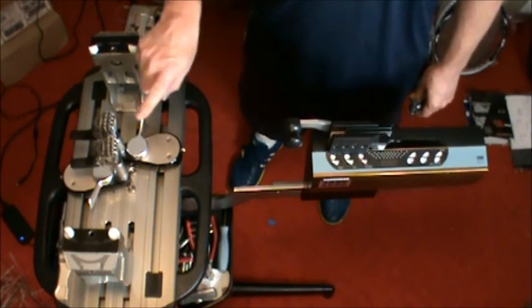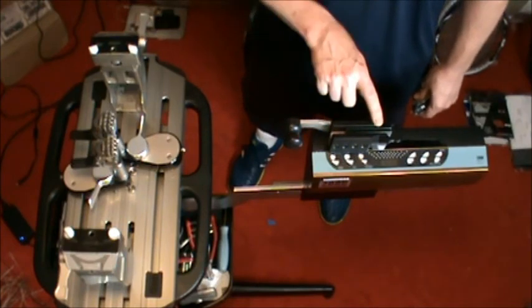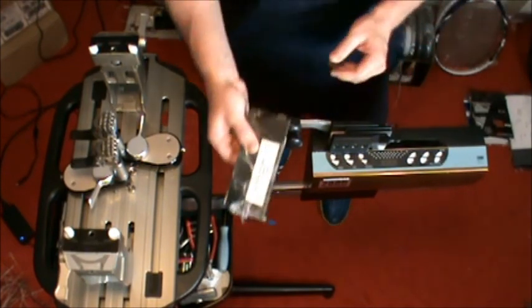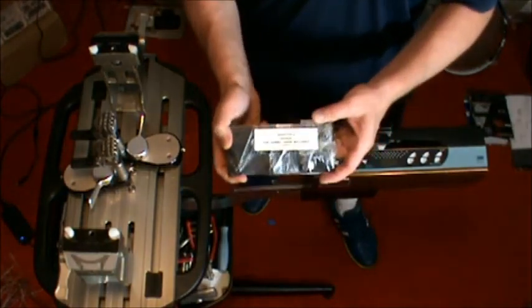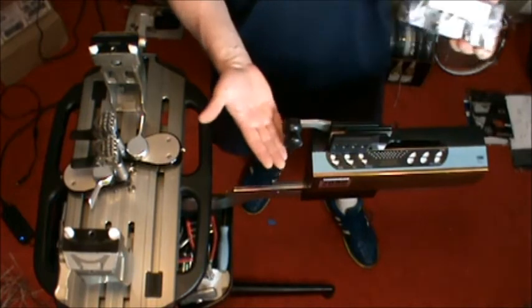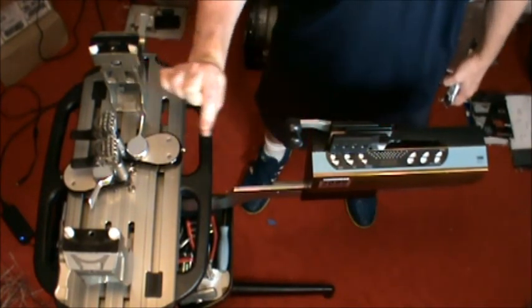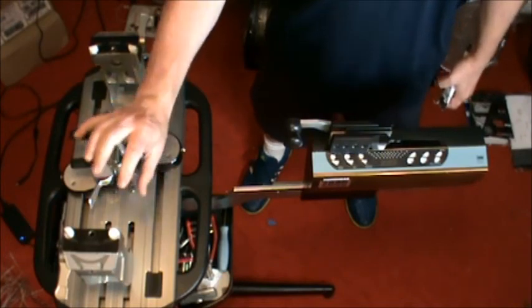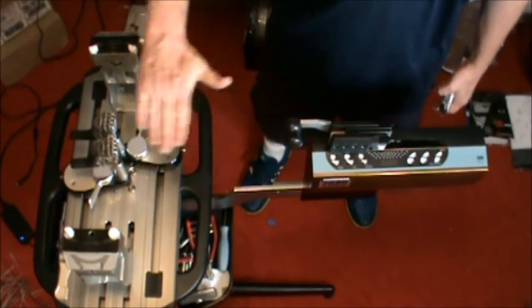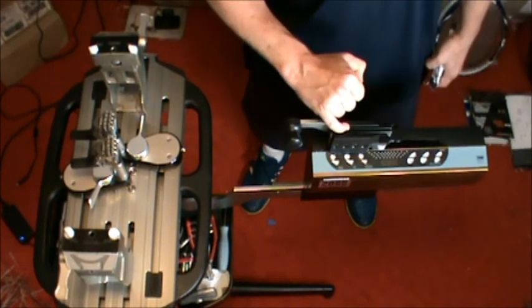So your pulls, the string angles slightly downward from the grommet, from the edge of the frame to the Diablo, and goes into the gripper. If you do choose to implement the gamma adapter, then this Diablo and gripper, the whole assembly, is going to sit 2 inches higher, which means that the string essentially pulls straight out of the grommet, at least for most frames. Once you've got a frame mounted, because the plane of the string bed right now is about 2 inches higher than where this gripper is.